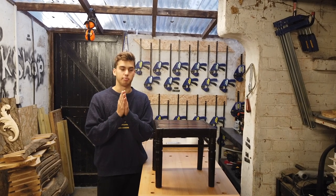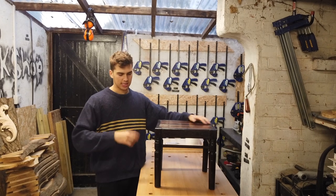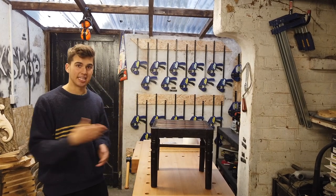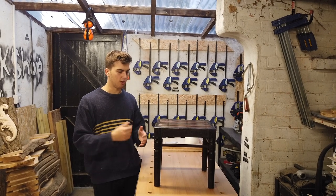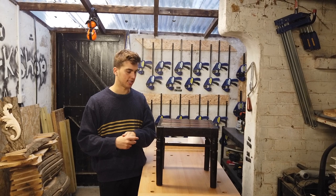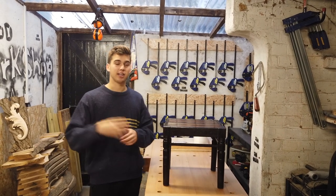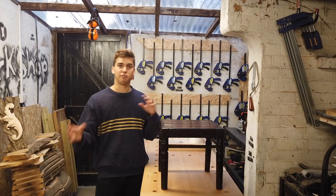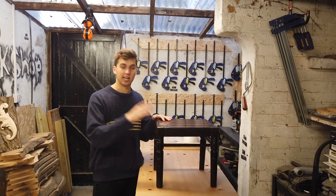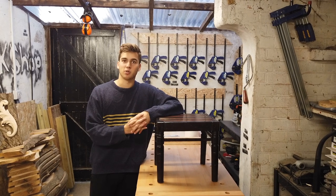Now that is because the crack between the leg and the table was just a clean snap, so there was a lot of glue surface. If the broken leg was more damaged with gaps in the joint, I would have to think about reinforcing it further with maybe a dowel. So if you have a piece of furniture, you've got to judge whether it's as simple as just gluing it back on, or if you've got to add a screw in a certain place or something like that. Hopefully that was helpful to you — if you've got a friend with a broken table this video might be useful to them, feel free to share it. I hope this video was useful. If you enjoyed this style of video where I'm giving you tips rather than a whole build, comment down below. If you're new to this channel, feel free to subscribe. Give it a like — thank you very much for watching, and I'll see you in the next one.